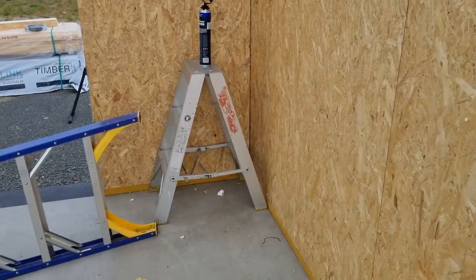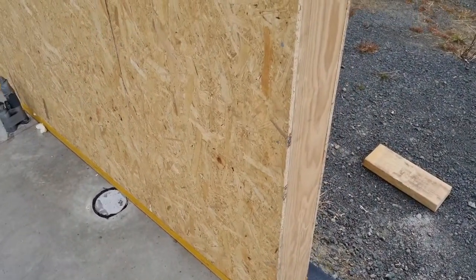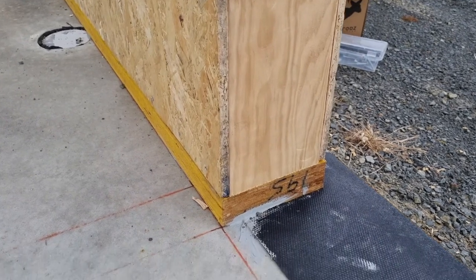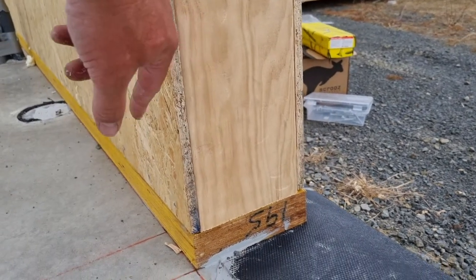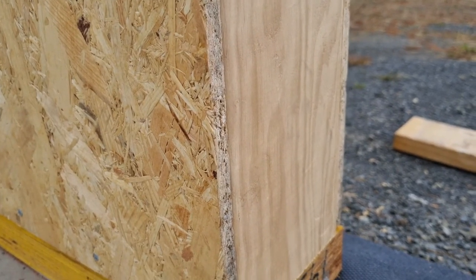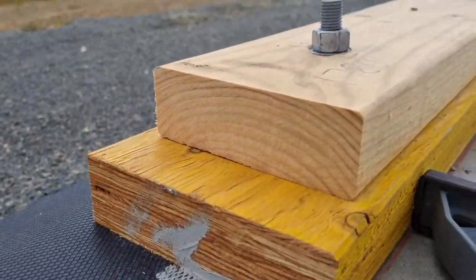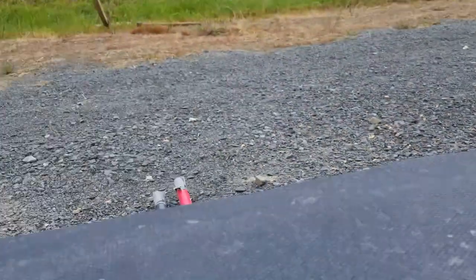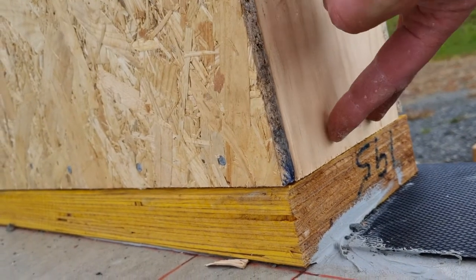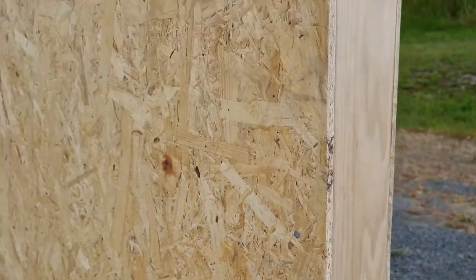I'd rather have overkill than underkill. The boards just weren't as perfect as we'd hoped — I was thinking they'd be machined within an inch of their life, but I think some of the boards have actually moved when they're pressing and not quite made a perfectly parallel board on each side. This is just part of the detail of how the end closes — these guys here fit down inside the hollowed out section of the foam between the OSB boards and connect to one of the base plates. Remember we've still got two base plates, so the one on top, the timber board, is actually inside the SIP panel sitting on top of this one. We'll drop a couple of screws into the end of that so it can't lift, but it's all nailed off at 150 centers through the bottom and 300 up the sides. We'll see how we go with the rest of it.